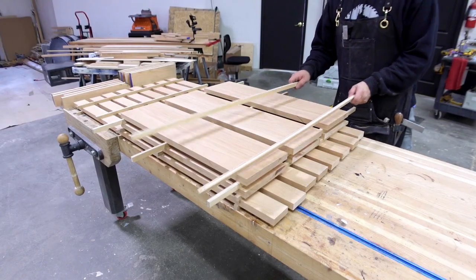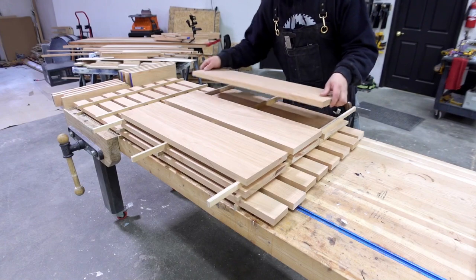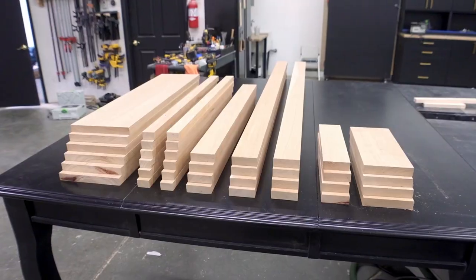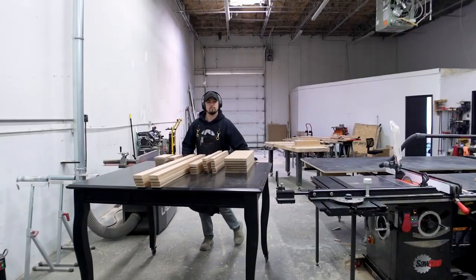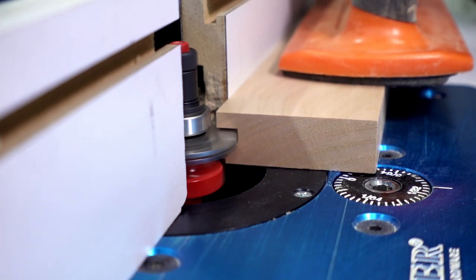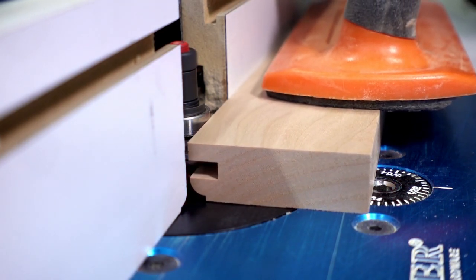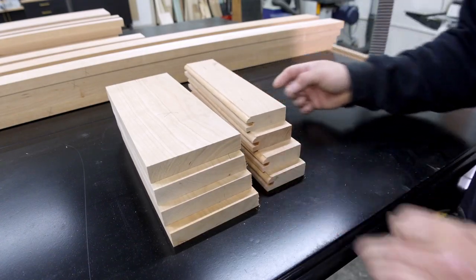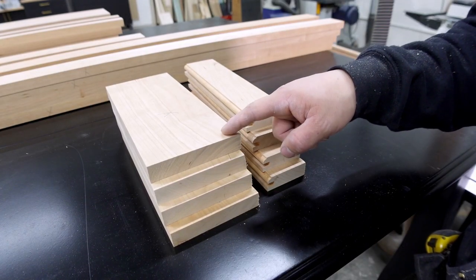By now, the boards for the doors have been acclimating overnight, so we can get ready for profiling. Using tables on wheels is handy to transfer them to each tool while keeping them organized. First up is the grooving bit, which doesn't have to be first. You can do the tenons first. I grooved the lower rails of the arch top doors, but not the upper large rails yet.